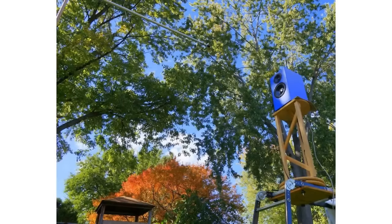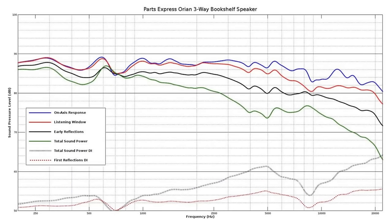Here's a picture of measuring the speaker outside on that table. The reason James takes speakers outdoors is to measure the actual speaker without room interaction, getting an accurate reading without room reflections. You can't do this properly in a room unless you have very special equipment. Outdoors, you only have one reflective surface — the ground — and that's easy to filter out, giving essentially anechoic measurements.